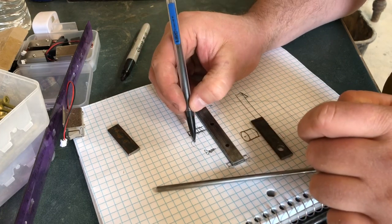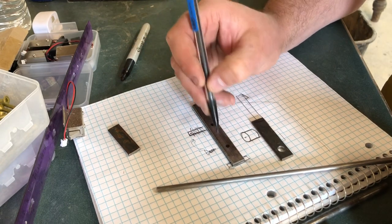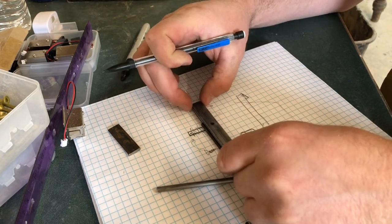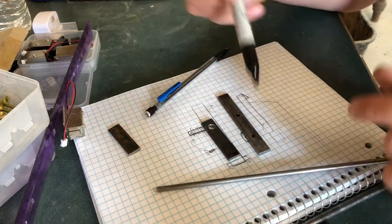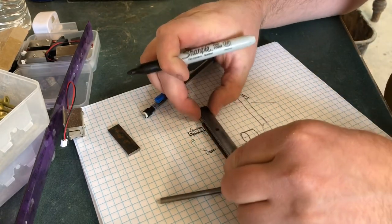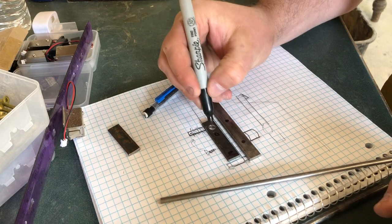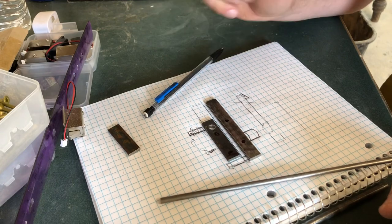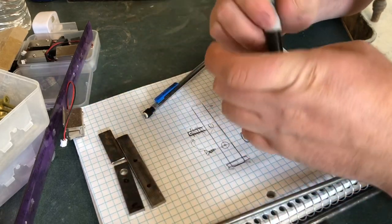Switch those two around so the button's here to push up, that is there holding it, and then these two would keep it centered, and then I would just screw that down. So I'd have to inset this piece, two screws so it doesn't pivot, both a peg coming out here and a peg from here going down. That's the button that pushes it up. Okay, that'll work. I'll draw that up really quick.